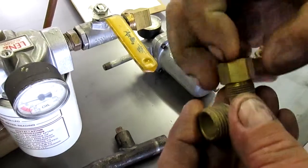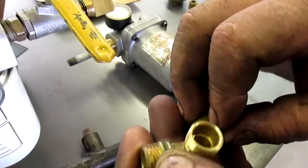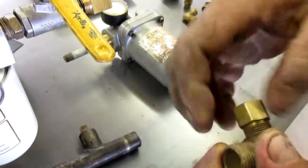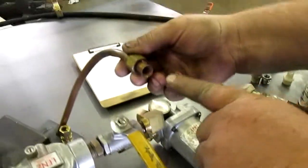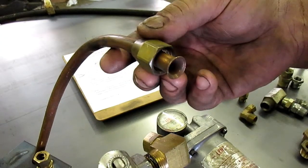Some people use compression fittings — these compression fittings suck air and will not hold vacuum on the suction side. Be sure you use a flare copper line on the suction side, and do not cut it off where it goes through the top of the tank.